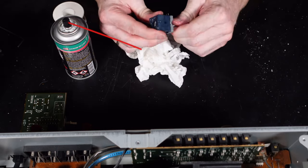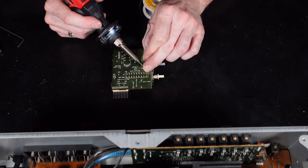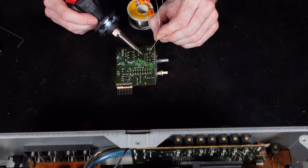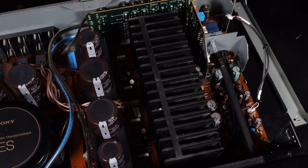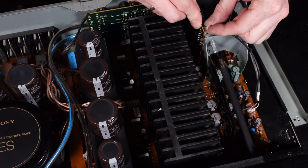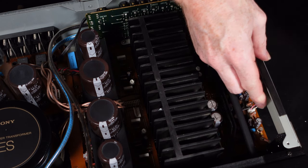Here it just shows me spraying from the outside of the component. I then soldered it back in place on the board and refitted it all back in the amplifier. It's actually rectified the crackling issue with the volume control and there's no dropouts of sound on the left channel, so luckily it has been rectified without needing to find a replacement part. The process of putting this part back shows the bits I took out to get it out — it was only the main circuit board for the volume control. There's a little bridge connector which connects that circuit board to the circuit board on the rear, which I think is like the input circuit board. Also there are some little connections which push into the main board from this board — they sort of fork into the bottom board. Then there's a couple of screws that hold the bracket in place and the two screws for the side frame part.